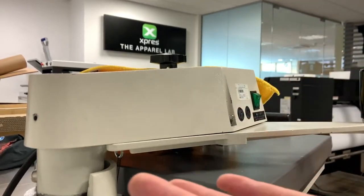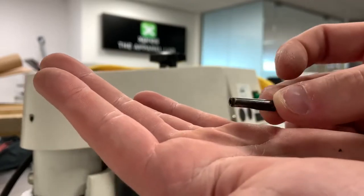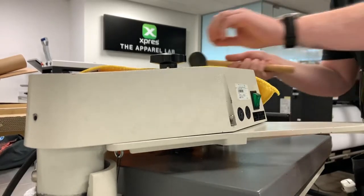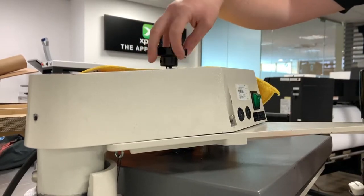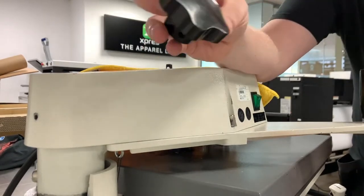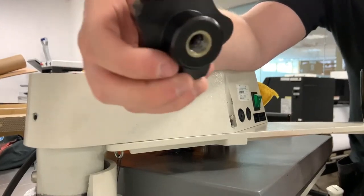It's probably quite hard to see, but the split pin is bigger on one end than it is on the other — it's almost impossible to see but it is. Which means that when you're trying to punch it through, if you're going the wrong way, you can actually break the handle quite easily. It's just a plastic handle so you need to be very careful not to break it. This is where the pin goes through — you see that little hole there — you want to make sure you hit it from the right side.